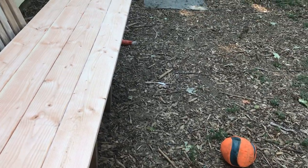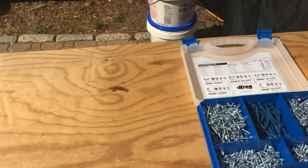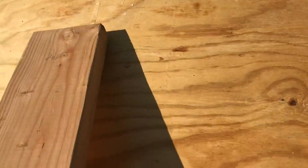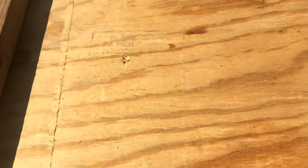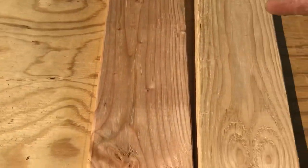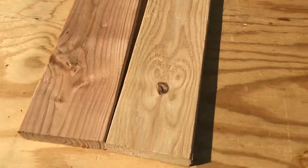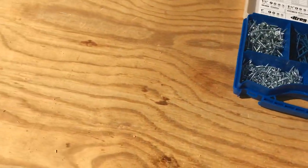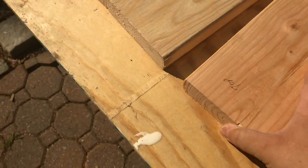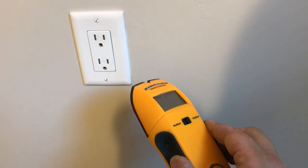Once that's done, let it dry and put it aside. We're gonna come over and start the left-to-right pieces — the small ones. I mark these 'top' — we're gonna put them upside down, drill the same pocket holes, probably two to three screws in each. We'll mark them, drill them, and do the same thing: glue each edge and put it together. First thing you're gonna need to do is mark out your studs for the wall braces.